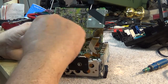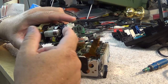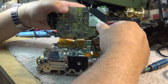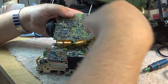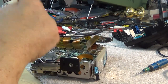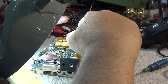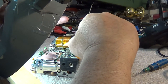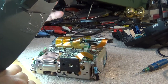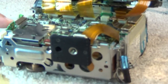Here's our layout: this is the camera section - this circuit board and the board back here comprise the CCD imager. Here's the lens assembly and all the signal processing for the camera. The signal from here gets passed on to the video board. The video board does all the processing, and I think the problem is probably on this board because it affects both playback and live signal. Most likely it's going to be one of these filters. This ribbon cable connects to the output connectors.